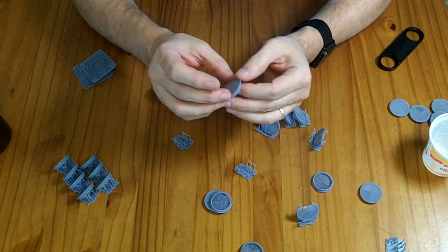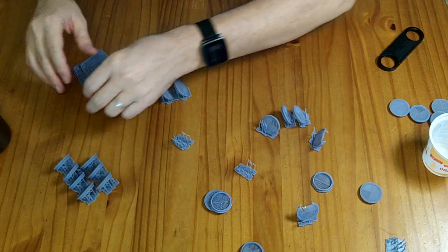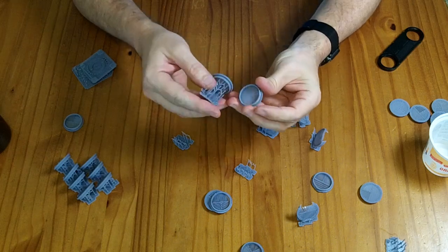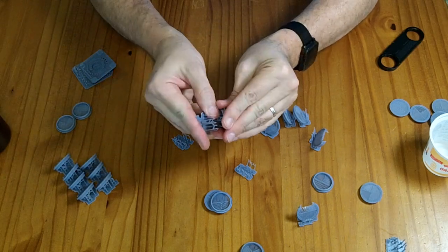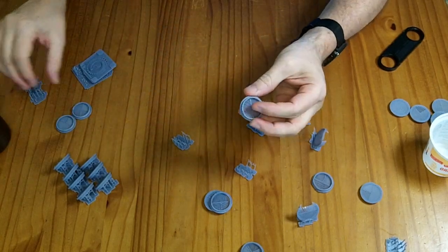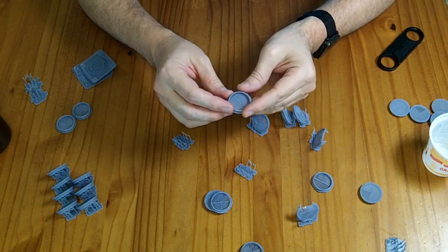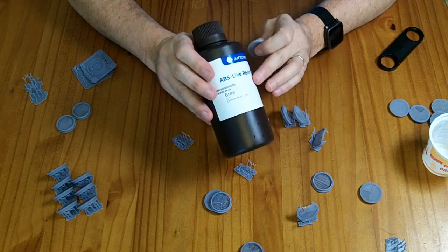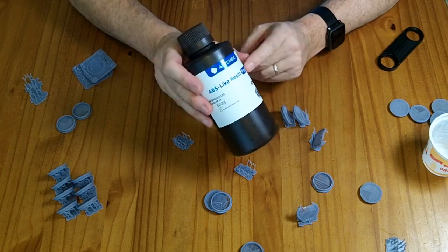This particular one threads in just fine. Mechanically and tolerance-wise, the print was very good — the threading is the correct size and the Bahtinov mask is nice and clean. Everything worked well once I got the settings dialed in, and using larger supports isn't hurting the print quality. It just means I can't get as many in one batch — I'm doing 10 instead of 12. This resin seems stickier and wants to stick to the film more than my previous resin, so you may need longer exposure times and bigger, more supports to counteract that.